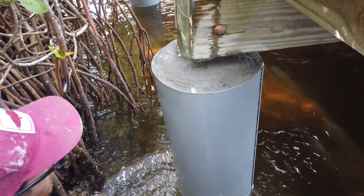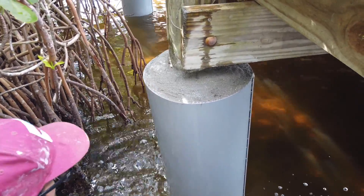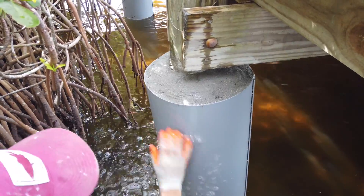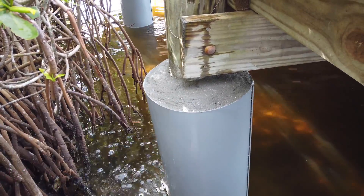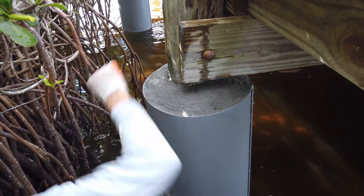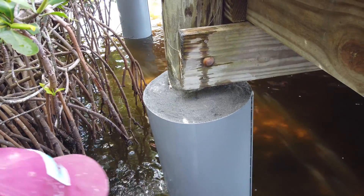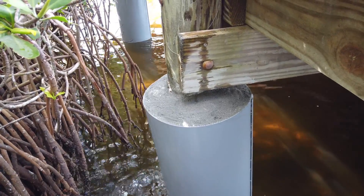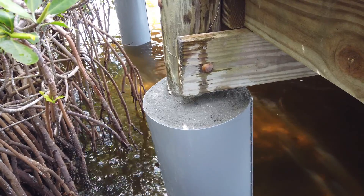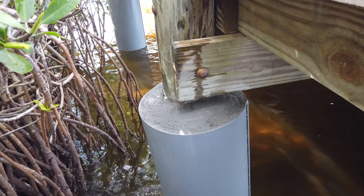Now this topping, it acts as a waterproofing. That'll keep water from sinking down into the concrete and getting in between the wood and the concrete. Exactly. This concrete is poured — it was sucking in water, like houses that don't have a good watertight paint. This is essentially watertight concrete. And that's the final cone — that's what it'll look like right there permanently.